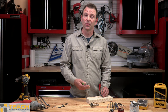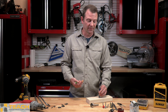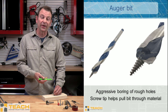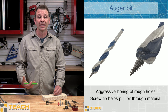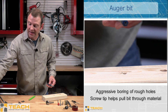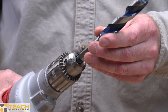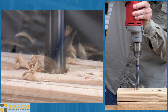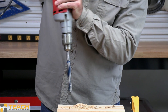In the same range of hole sizes as our spade bits, we have an auger bit. This is a heavy duty version of a drill bit. This auger bit has a screw point on the end and very deep flutes that are going to remove a lot of material from the hole as we're boring. This bit also has a hex shank — six sided — that would fit into our chuck. We're asking a lot out of this bit, and when we put it in our drill it needs to connect tightly and stay there, since there's a lot of material it has to work through.